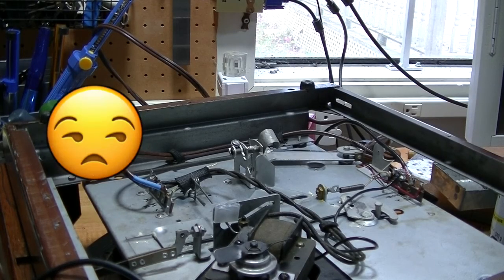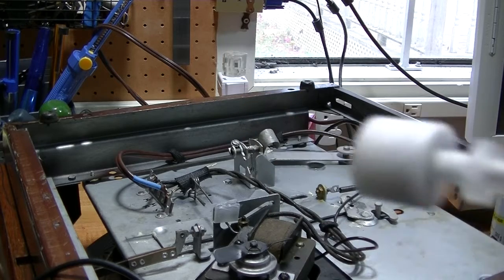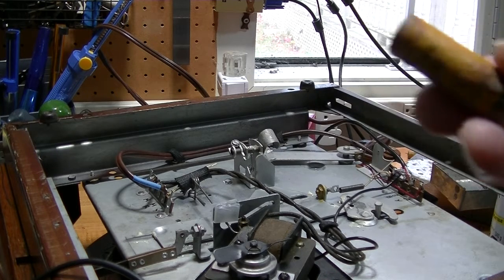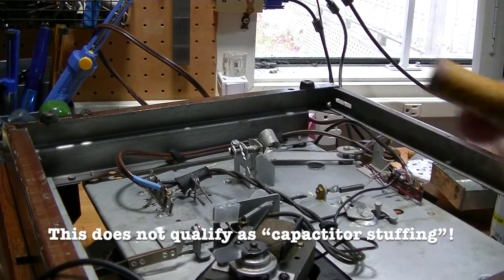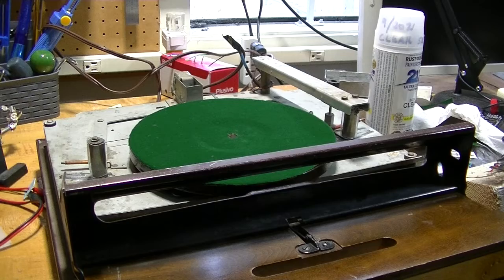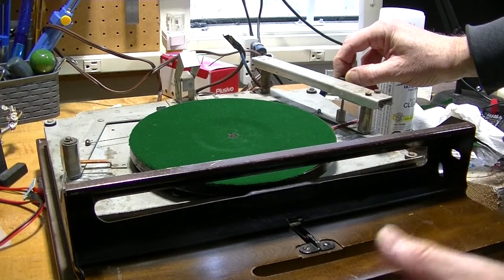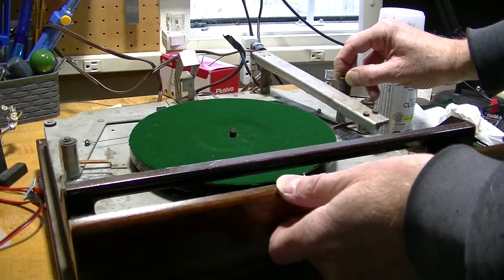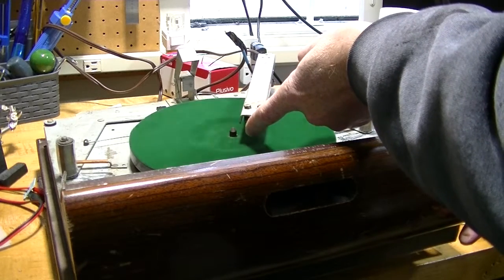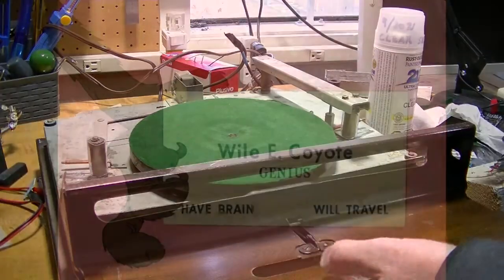The mercury switch is no good. Here's my solution: here's the cylinder from a paper capacitor, and here's a float switch — it's a reed switch with a magnet around it. I'm going to embed this in this and attach it to that. Here goes with the new float switch used as a tilt switch. I open the door, simulate the record being put in, close the door — the record plays until it reaches the middle. Then I open the door and it's off. Genius.